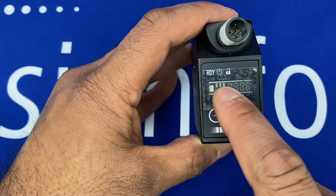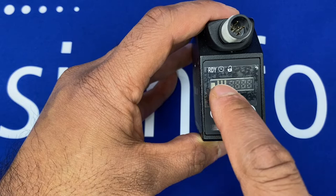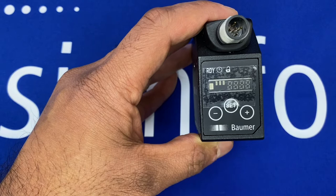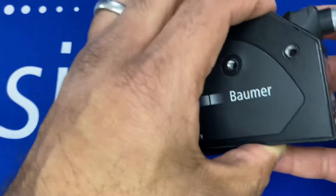There are LED indicators: the first LED tells you the output is on or off. The first smaller LED tells you the sensor is ready, whether the delay function has been enabled, and whether the sensor is locked for adjustment — so it's ready to run and you can't adjust the switch point until you unlock it.